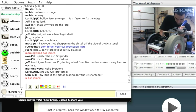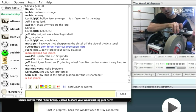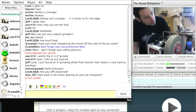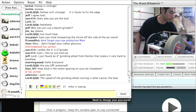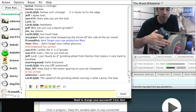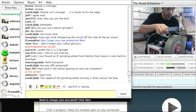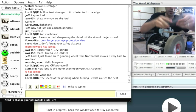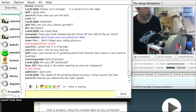You turn it on — there's an RPM speed control on the side. Just go back and forth; it doesn't get any simpler. If chisels are in pretty good shape, it only takes a couple of minutes per bevel. They also have a grading stone — you hold it on the wheel to change the surface texture, giving it a rougher grip for aggressive sharpening. Once you finish the rough work, you switch back to the fine grain side.